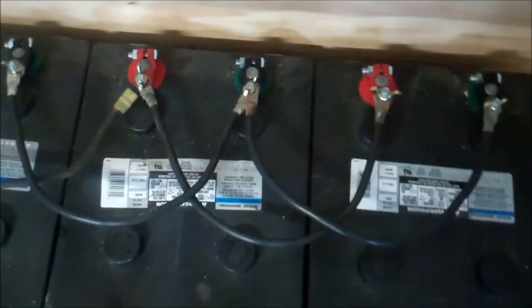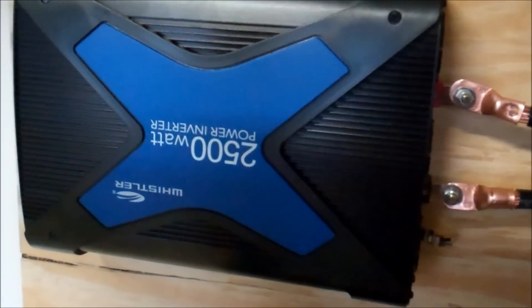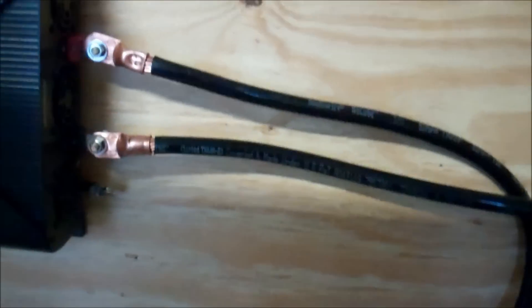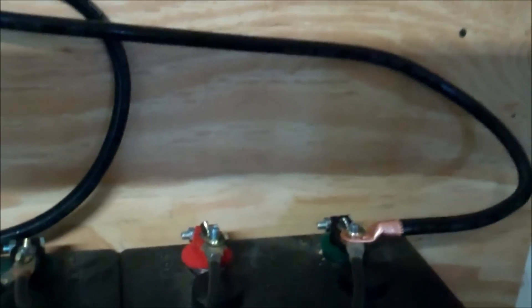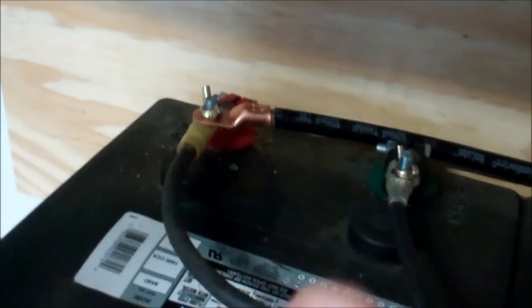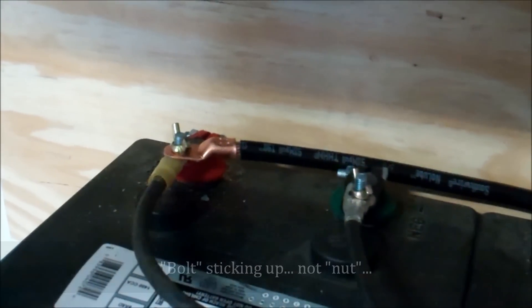It's going to be a nice backup battery bank. Here it is all hooked up — number four wire running between the batteries, connected to a 2500-watt Whistler power inverter. I'll put a link below; it's highly recommended with great Amazon reviews. These battery terminal adapters with the posts sticking up give you plenty of room to add things — if you want to add solar, you can unscrew that nut and add a lug from your solar charger.